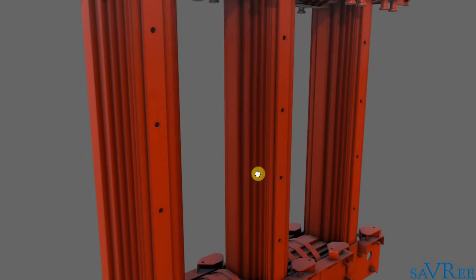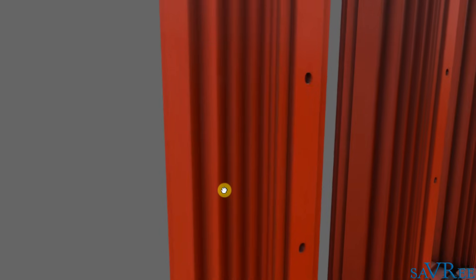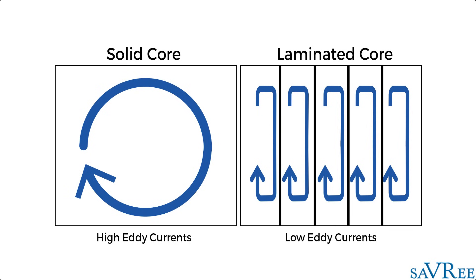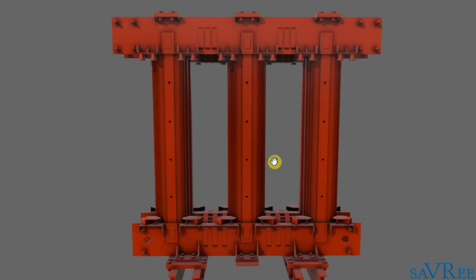You can see on the side here that we've got these straight lines. These straight lines indicate to us that the sheets are of a different geometry, and as you've clamped them together, you get this wavy pattern. If we move over to another limb, you can also see it over here, and that's because the core is not perfectly cylindrical. The reason that we clamp these very thin laminate sheets together is because we want to reduce the hysteresis and the eddy current losses. Each of the sheets is insulated from its neighbor in order to completely isolate each metal sheet to reduce eddy current and hysteresis losses.